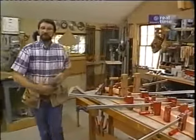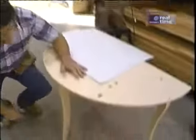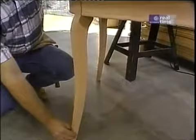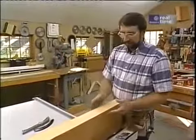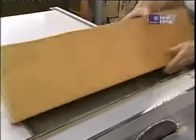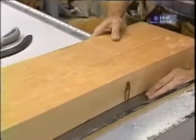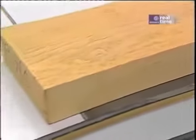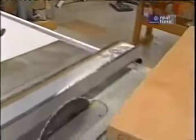So while those are drying, I think I'll start working on the legs, which are not a laminated piece of wood — they're a solid piece of sugar pine. When I went down to my wood outlet, I went immediately to the short pile — a pile of cutoffs. I was lucky enough to find a piece of 3-inch thick sugar pine that was about 16 inches wide and 3 feet long. A little bit pricey — $70 — but that was enough to make six legs, or enough for two tables. I've already cut off three for the prototype, and now I'm going to rip three more pieces 2 and 1/8 inches wide.